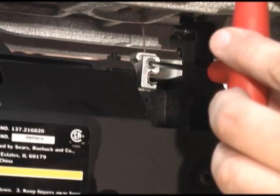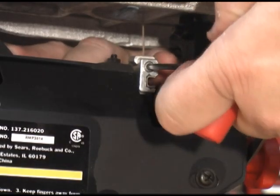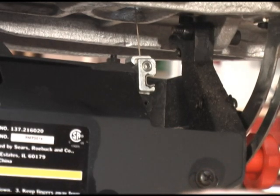So the thing to do is get it in there to where you have just got it slightly snug, then work a finger in around to the front and hold that chuck tight while you go ahead and apply the extra pressure to that set screw. Now we have got the bottom chucked up; we will go up to the top and chuck it up on the top also.